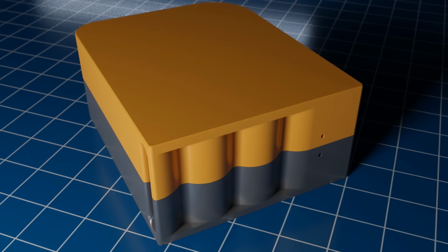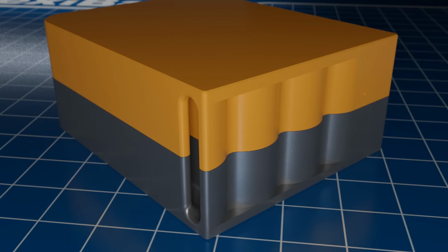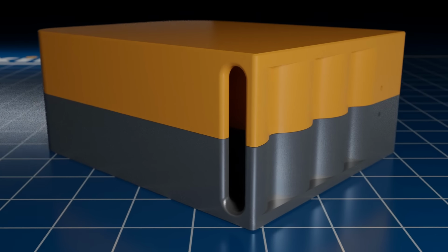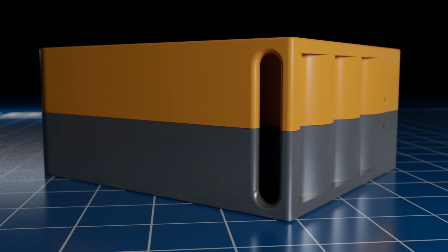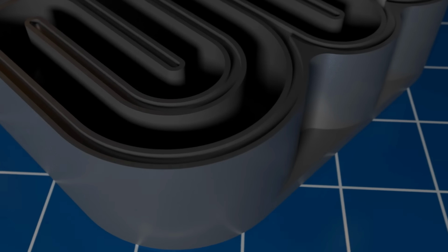And as you can see, I also redesigned the exterior to reflect some of the internal geometry, namely the layout of the waveguide, which I think we can all agree is the defining feature of this model. Internally, not much has changed, but I did revise the cross-section of the waveguide a little to improve the laminar flow, and adjusted the volume of the coupling chamber accordingly.